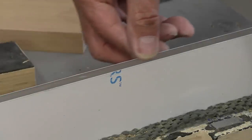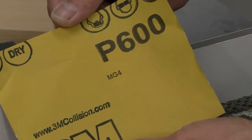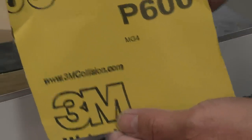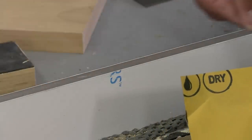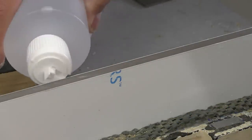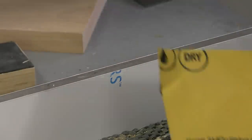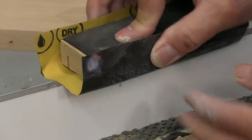There you can see the difference that the 400 or the 320 grit made. I'm going to use some 600 now and just take it down a little bit more. I'm going to put a little bit of water on there and hopefully that will lubricate it as well. Let's put a tiny bit on there like that and see if that'll polish it even a little bit more.